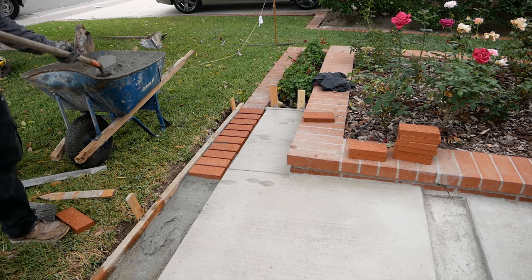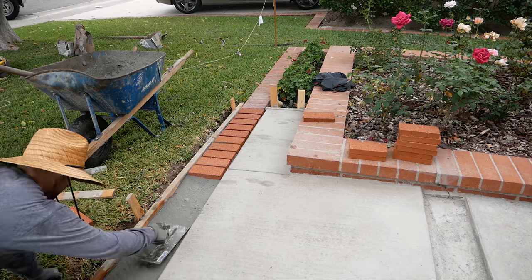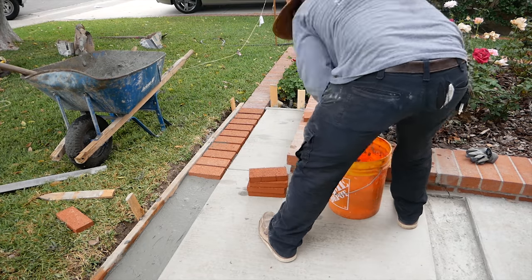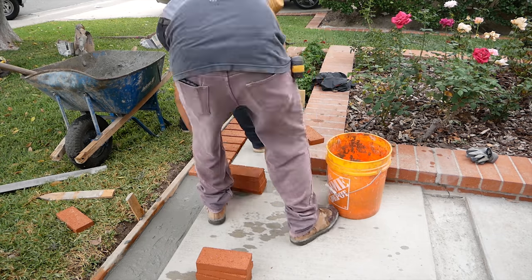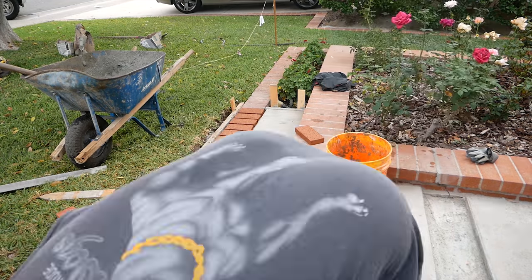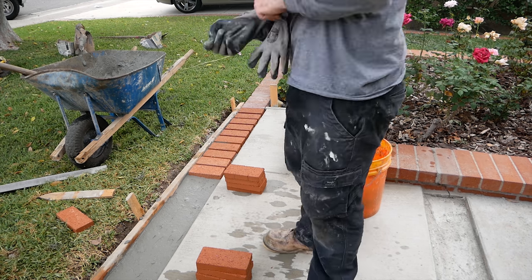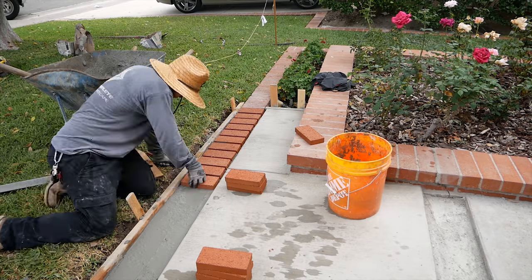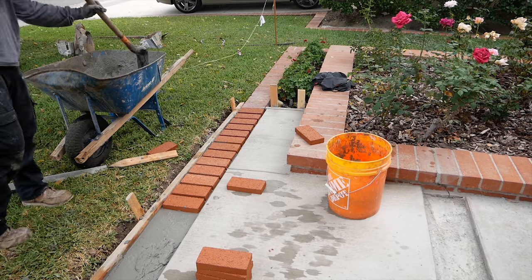We left the outside form on for elevation so we can level across. When you're setting these bricks you just put any straight edge — it doesn't have to be a level. You just want to maintain the existing slope of what you're working off with the brick, otherwise it's not going to look very good. For instance, if you have a driveway that slopes one way and your brick ribbon on the edge is at a different slope, it's going to be pretty obvious. So you just want to maintain the existing slope.